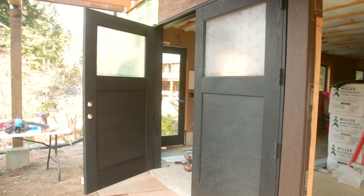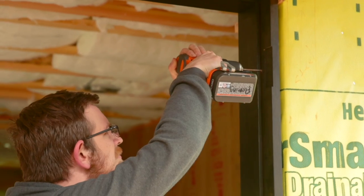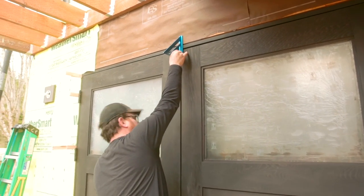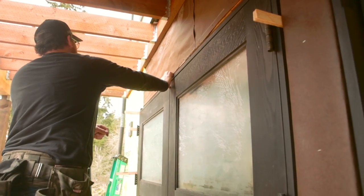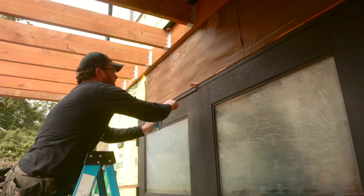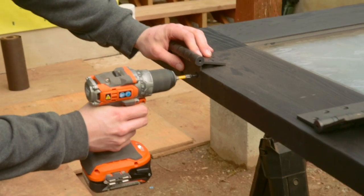The reveal is the gapping around the door to the jamb — typically about an eighth inch or just under, running from the header down the jamb legs. The center of the door needs a little extra room since it's swinging, and it's a wood product so it will expand and contract — normally about a quarter inch in the center, maybe a little more. In this situation, the tops of the doors were misaligned in height by about a sixteenth or less, so we shimmed the bottom right jamb leg to lift it up, which brought it right back into alignment with all the reveals staying the same.